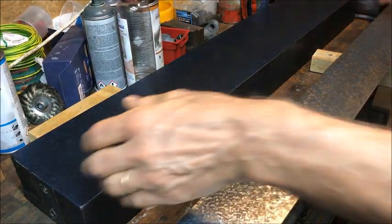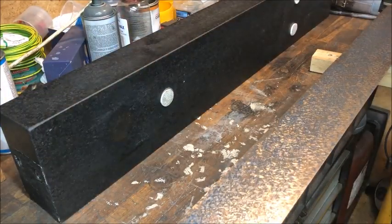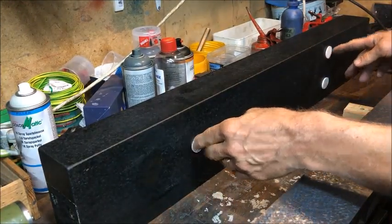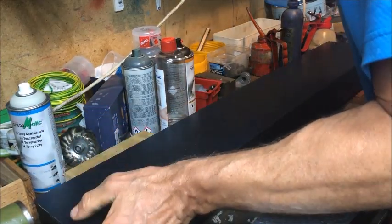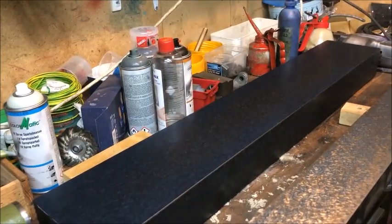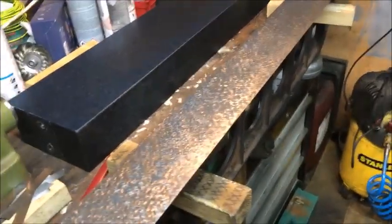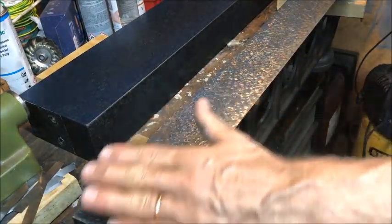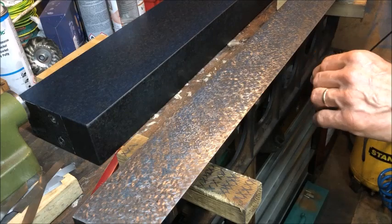This is as opposed to this beam here, where I've intentionally put three points on so it will even out the weight and be in balance. Having used it a little too far out on the straight edge, that straight edge became high in the middle. That was no disaster really — I know it was flat to the other plate, although high in the middle.